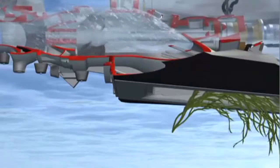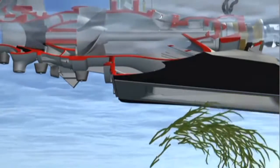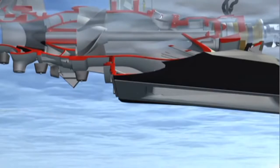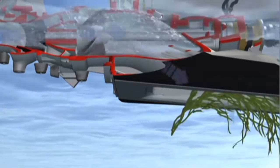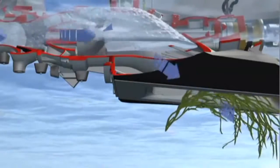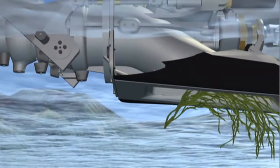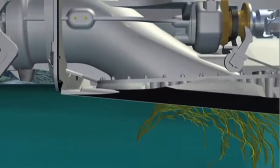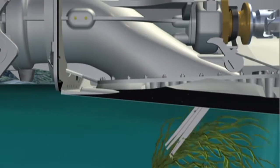The simplest way to clear the blockage is to turn the affected engine off and wait for the blockage to float clear before restarting. This is best done while the vessel has some headway. If your vessel has a reversing gearbox fitted, you can reverse the rotation of the Waterjet impeller to push the blockage clear of the intake — this is called back-flushing the Waterjet. If intake blockages are a common problem, you can have your Waterjet fitted with an intake screen rake. Activating the screen rake lowers a set of bars down between the bars of the intake screen to push the blockage clear.